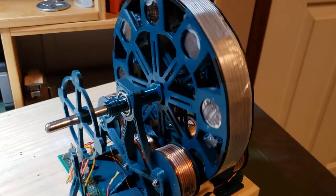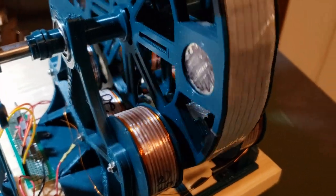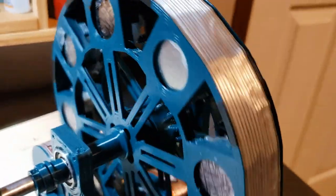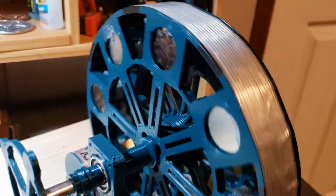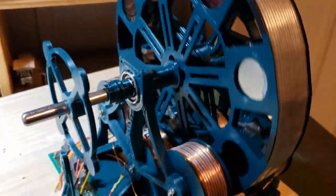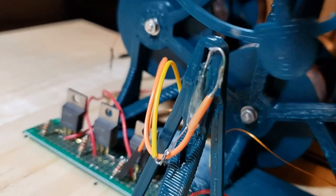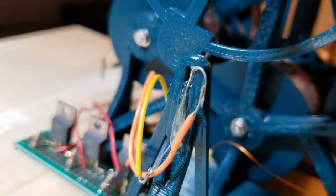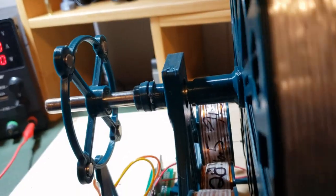The magic behind this is high-resistance air core coils and very strong magnets — one inch by one inch N42 Neomags off of Amazon. Triggered by a little reed switch, one of those little micro ones. You get like a hundred of them in a pack for like five bucks, and little tiny magnets to trigger them.